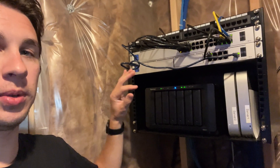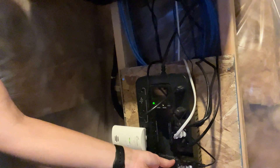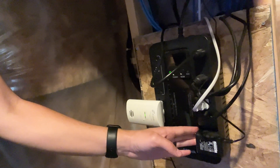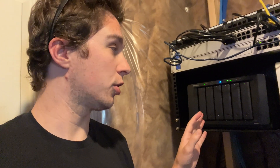Eventually the entire basement will be finished — it'll all have ethernet in every single room, and those will pull right into here. We've also got a power supply unit here. Half of it is battery backup, so if the power goes out we can restore power for about 40 to 45 minutes, so the servers and the hard drives will continue to run. Best case scenario is the power comes back on with no downtime. Worst case, it will start to beep with about three to five minutes left, which will allow me to jump in and turn them off so the hard drives don't incur any damage and we can shut everything down completely.